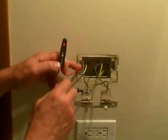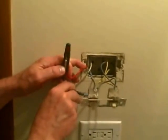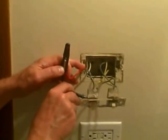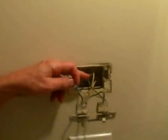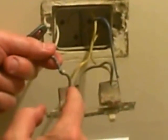I'm going to use the tester to check the wires and see if it's live. The top is live here. This first switch is turned off, and when I touch the bottom screw you can see there's no flow of current. So I know this top wire is coming from the breaker box — and this is a really unique wiring scheme. It's coming in from the breaker and they're actually looping the wire all the way through. They've stripped the wire in two places and allowed it to go to something else, most likely this outlet down here.